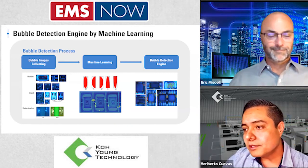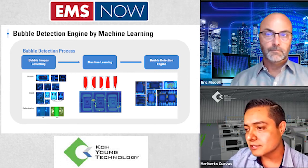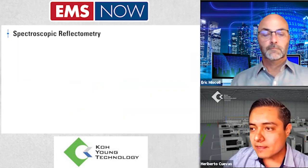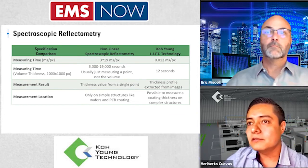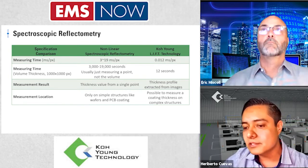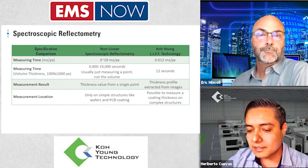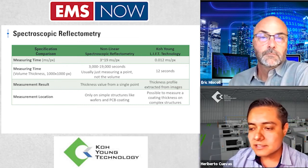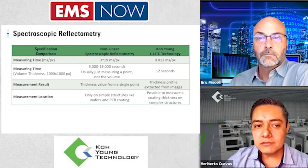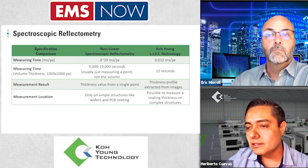Going to advantages over traditional technologies — in general terms, it's faster, more accurate, and results can be exported to TXT or other files for SPC purposes. With all the information on how the machine is measuring, we can have Paretos, charts, and histograms as needed. That is the main advantage of having this kind of technology. Easy to use means having the best performance inspection in the least time possible with the least skills required. We summarize this as an easy process guide — you can have PCB files like Gerber or CAD, or simply draw an ROI in different shapes in areas you need to inspect, then check a box for the kind of inspection needed and set the tolerance.